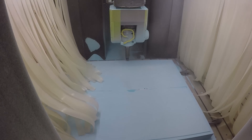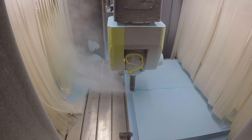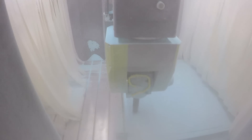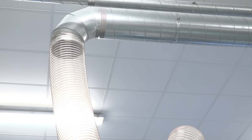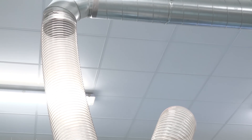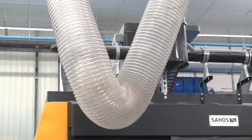Machining board fast creates a lot of dust in the machine, doesn't it? How do you go about getting rid of that? Well, that's a big concern because the dust it produces — an awful lot of the stuff, particularly on a big piece of board. We need to get rid of that, protect the operator and protect our machine from all this dust that's going to get into the workings. So we expect a big extraction system on this machine, and if you look around the facility, you'll see it's taking the vast majority of the dust rather than just letting it float around in the air.